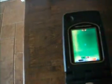And the area where it's actually missing the insulation is the wall. Starting here, you can see my little laser light, and it runs right the way up here, all the way up to the top. There's no insulation in that wall at that point. You see it starts here, see where the camera changes. So that's going to let a lot of heat in.